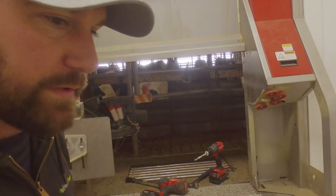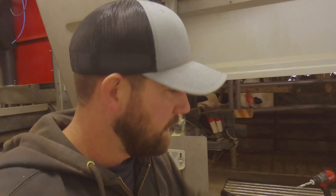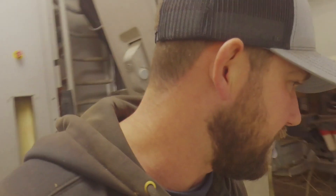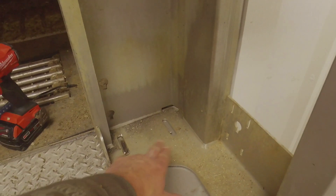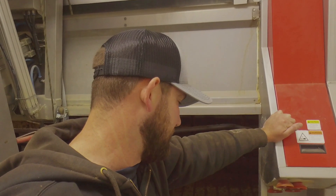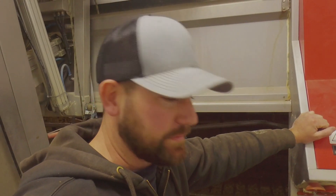A couple of weeks ago the concrete in this area was getting all worn out from the other robots, so we got that stainless steel piece on — that's looking cool. One problem I have is the mounting holes didn't line up right. Stainless steel is not very fun to drill through, so I'm cutting some slits and then trying to drill through enough to get a lag in there.